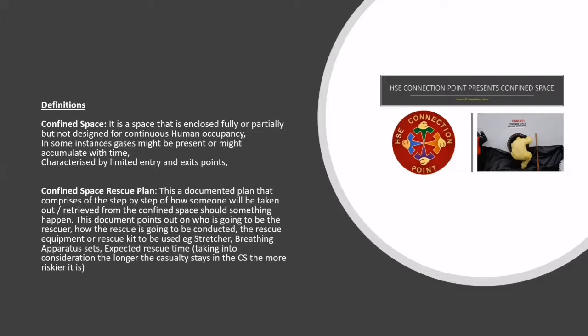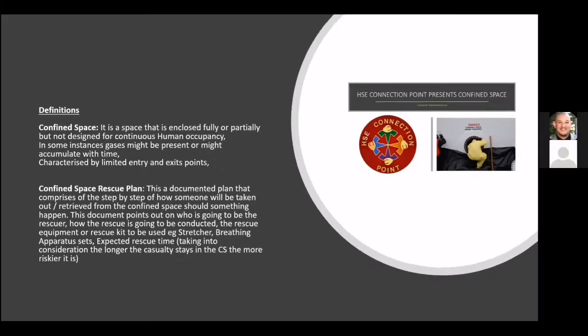The main reason being, if you are working in a gaseous area, all the gases and vapors tend to find the lowest point of the ground. That's where you'll find them. So if you are to excavate and you dig your trench there, the reason why they regard that as a confined space is because now you have created an opening that is deep,